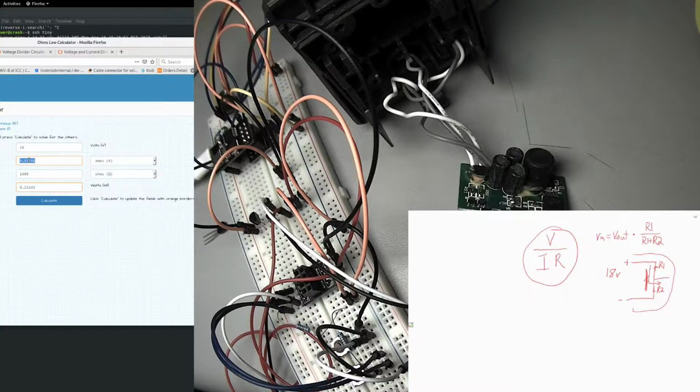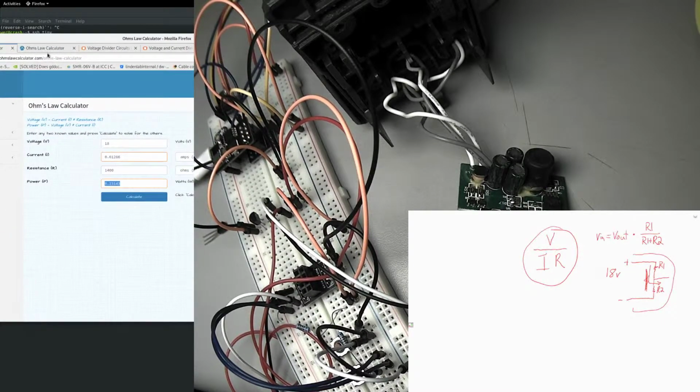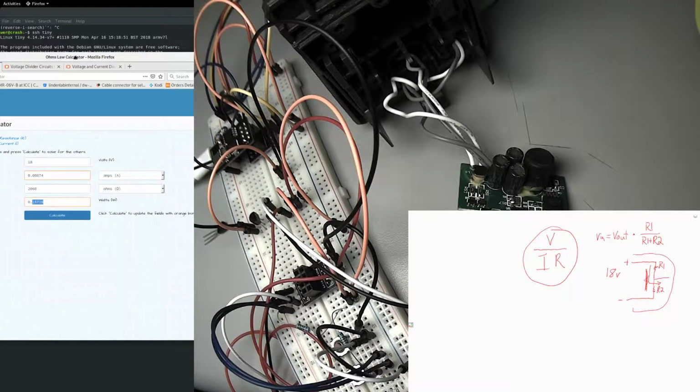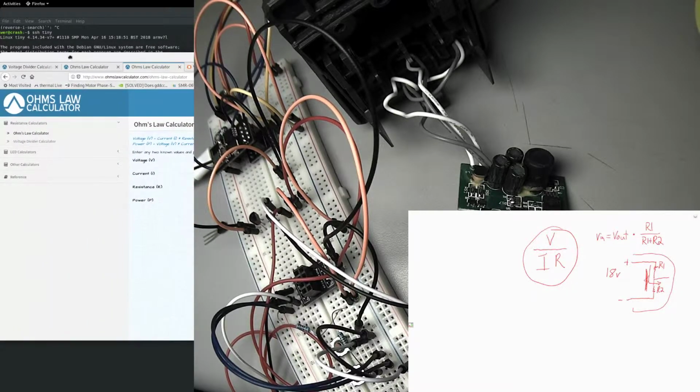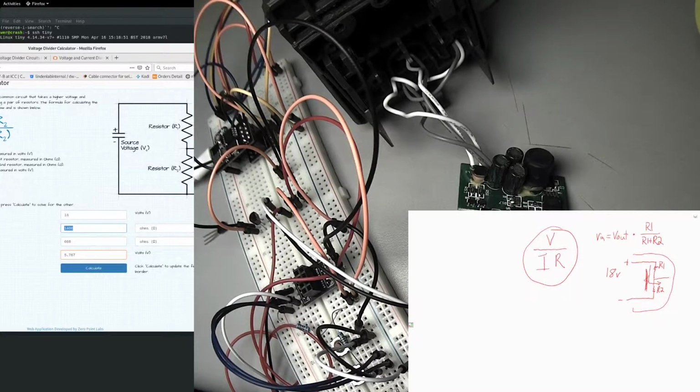to supply the ESP8266. And here I'm pushing a quarter watt. So like that's kind of my typical resistor. That's all it's going to be able to dissipate anyway, right? So, and then overall, the entire system from 18 volts to ground is just going to be throwing away 8 milliamps. It's just going to be throwing away a tenth of a watt. Is that right? And this is all to get me to roughly 5 volts, right? I'm still going to have a regulator because I need regulated output.